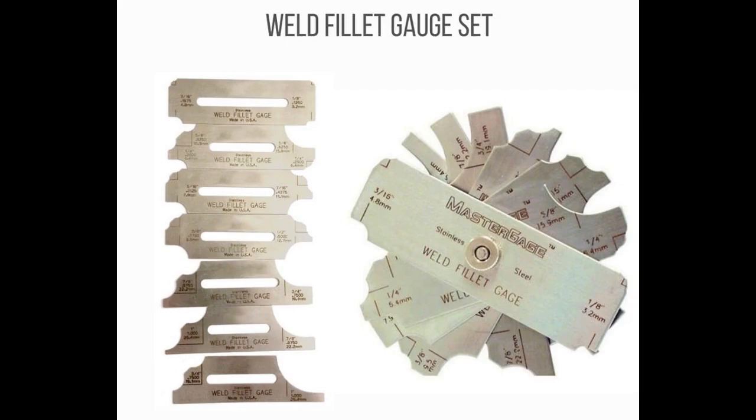Number 23: A Versatile Tool for the Welding Operator. The tool can be used with ease for weld joint preparatory functions as well as for checking of the weld joint. It combines a bore gauge, angle gauge, depth gauge, and weld height gauge, and is made in stainless steel with a polished finish. Features include: measuring concave or convex fillet welds ranging from 1/8 to 1 inch in size, stainless steel construction for durability and rust prevention, durable laser-etched size markings with black ink fill for improved visibility, and precision-cut smooth edges to prevent cuts during use.